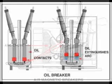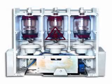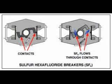In some switches the contacts are immersed in a container of non-conductive oil. When an overcurrent occurs, the arc heats the surrounding oil forcing it to flow violently; the rapidly flowing oil displaces the arc gases and breaks the arc path. Some switch contacts are placed in a vacuum to avoid arcs. Sulfur hexafluoride (SF6) is an insulating gas used in large switches in two ways: in puffer designs it blows across the contacts as they open to displace the arc gas, and in blast designs it is used at high pressures to open the contacts simultaneously, extinguishing the arc. SF6 switches are rated for the highest voltage of all breaker or switch designs.